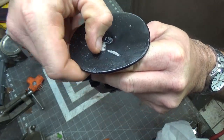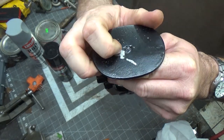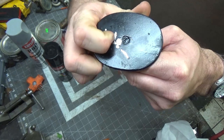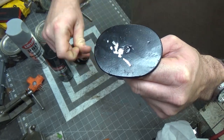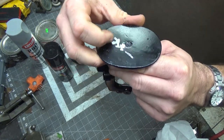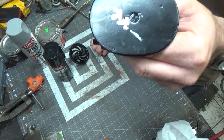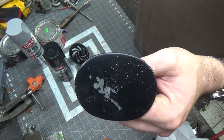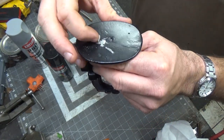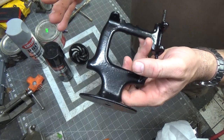But when I take my fingernail and I dig along here, the paint comes off on my fingers. And this has been drying. I put maybe one light coat on every 24 hours, give or take. This was bare metal, absolutely as clean as could be. And then I sprayed it all down with a paint gun full of mineral spirits to clean everything off. I made sure not to touch it with my hands and get any oils on it.